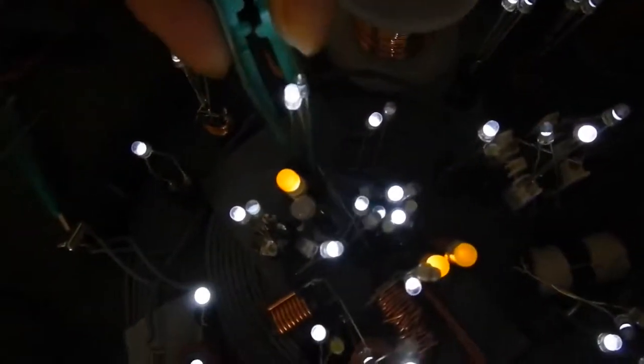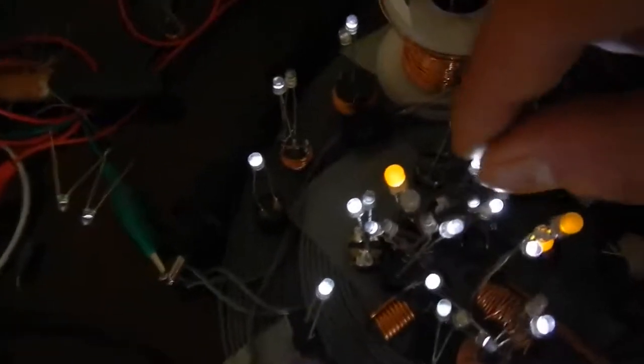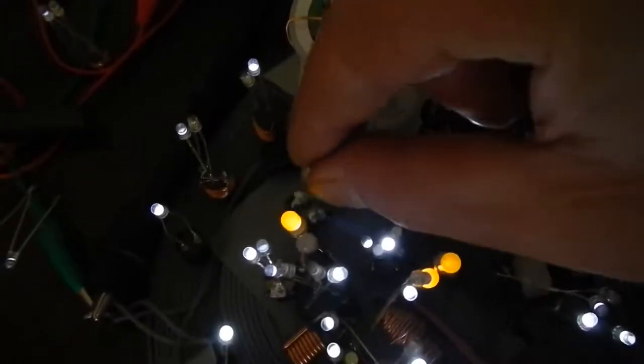And a lot of these ones that are in here, like that one that's fallen down, are actually the unmodified SMD chokes, and some of them are tiny. And I can get them to light. There we go, that one just stood up and lit. This one here. That is an unmodified, tiny little baby SMD choke. If I can get it in the middle there, you can see it does indeed light up. And there's a couple of those in there. There's a bigger one here. That's the larger style SMD choke, unmodified. Just LED solid straight on. That wouldn't work at all before without tuning this system.